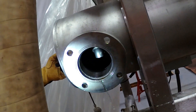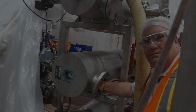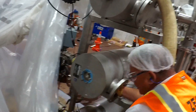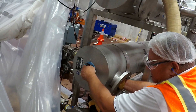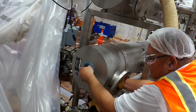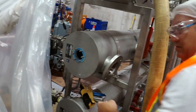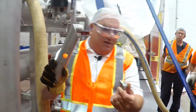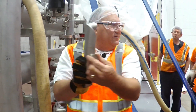We need to take this bolt off to be able to slide that out. Push it all the way to the end. Now you're going to remove the lower bearing — put a wrench on and loosen it. Once it's loose, it comes out fairly simply. This is the lower bearing. Now with that out, the hydraulic motor will come right out. On reassembly, you can't put it back in wrong — if you put the hydraulic motor in the wrong orientation it will come out. It has to go back in so that the pin sits in there correctly.